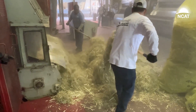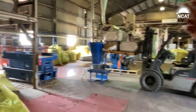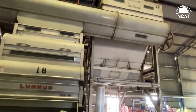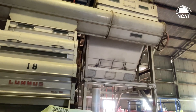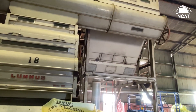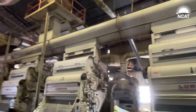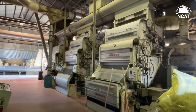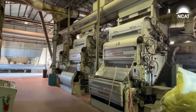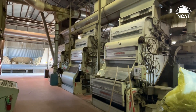This slide is modified too. The fiber goes over to another machine — an incline cleaner in a slightly different configuration. From there, talking just fiber now, it's augered down through the conveyor distributor. We've modified the two gin stands down there — the last two that look different — and in the back of those we've also changed the lint cleaning process.